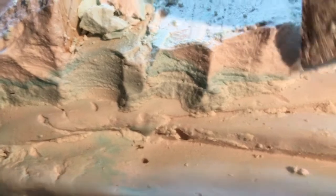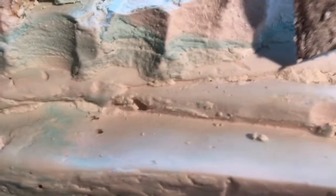You can see that this line of the register coat, there's actually some white plaster between it and the job in the model, the positive. So it's important to know that you've got to go until it lets go and pops off, because you want to get all this off. Now see, there's some air bubbles in here. This isn't going to be a bronze, it's not a big deal. That's the kind of thing that you'll have on your first one.